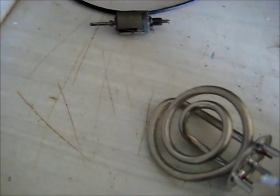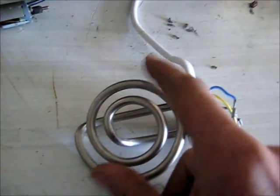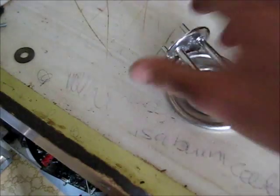Then have that all ballasted in case there's any shorts, and then get up on the Variac. This will just take up all the amps. See, if there's a short in here, it's not going to build up here or blow any circuit breaker. All the amps will be accumulated in here if there is a short, and that will just get hot and prevent any fires breaking out.